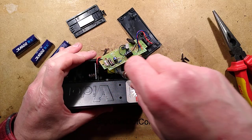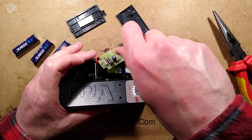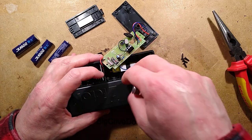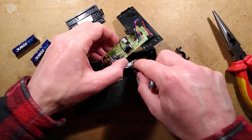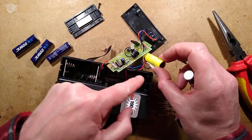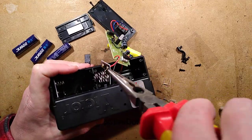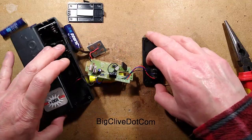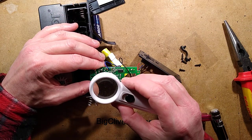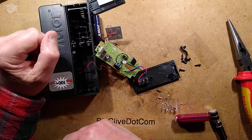This is the point of this channel, isn't it? We're supposed to take things to bits. The use of what I'm guessing is just a big chunky transformer here — a ferrite core with wire wrapped around it — is probably because it has to deliver fairly high current. It's not a super high frequency coil; it will deliver high current at fairly low frequency. I don't see any big capacitors. I see a ferrite core and loads of tape with windings wrapped around it. After a lot of reverse engineering, that was quite an unusual circuit.